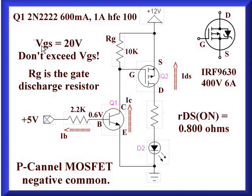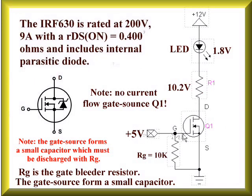A quick note on voltage gate-source. On both of these transistors, you switch them on and off by a voltage difference between source and gate. In the case of this setup, where the source is going to VCC, I have to have a gate voltage of at least 5 volts, preferably 0. VGS is the maximum voltage difference between source and gate — if you exceed 20 volts in this particular transistor, you will blow the transistor. On the other side, the most you can put on is 5 volts, so that's not much to be concerned with.